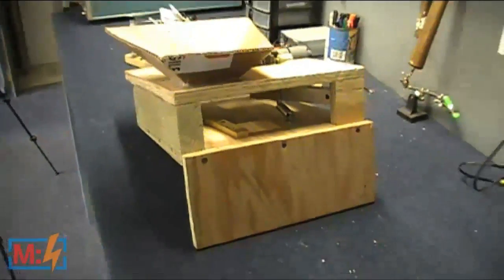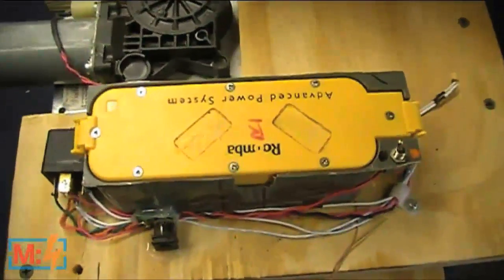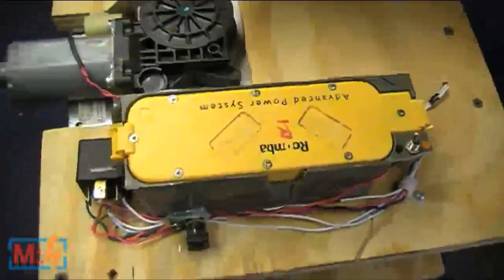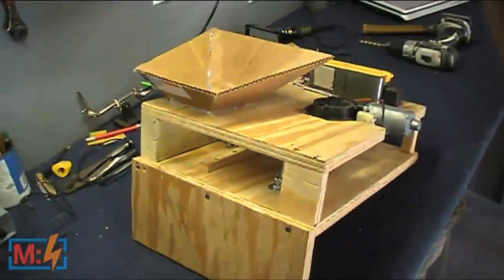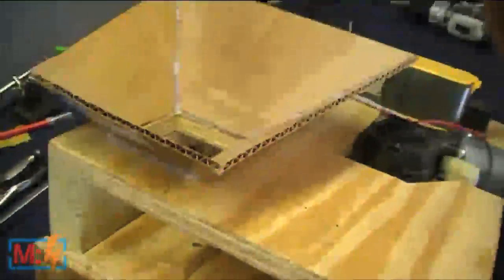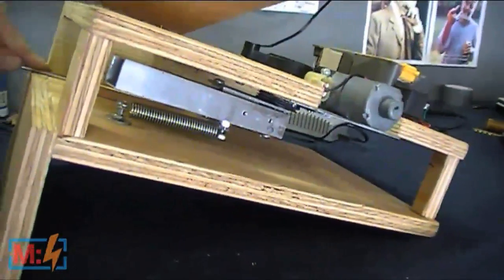Let's take a closer look at the launcher itself. This is where the ball comes out. The ball goes into this hopper area right here, drops down into this chute. It's powered by a Roomba robot battery — I hack a lot of things out of Roombas, they're really handy. There's a charger port still on it. I need to monitor the charge basically by just the temperature of the battery; there's no automatic cutoff. The relay handles the load from battery to the power window motor. There are three switches on the entire device: one is the on-off switch, and the one that triggers the ball to launch is a small micro switch inside the chute — salvaged from a printer — it's a limit switch, very sensitive. When the ball hits that, it starts everything into motion and gets the arm rotating. As the arm rotates, it launches the ball, then needs to come back and park itself. The parking is handled by another small micro switch on a cam on the round part of the power window motor.